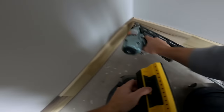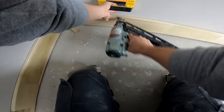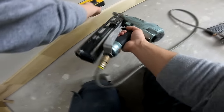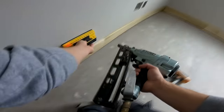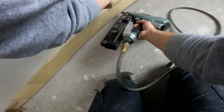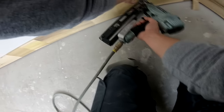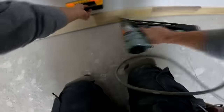These days there's a lot of hardwood going into new homes, and one nice thing to do when nailing off baseboard is try to keep your bottom nail low enough that the shoe molding will cover it — that's just one less nail hole that could show up and be visible after paint. Usually for short runs of baseboard I'll just use my stud finder, but for longer runs I like to lay out my tape measure on the floor and use the red marks to go every 16 inches and put a nail where it needs to go.